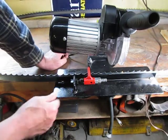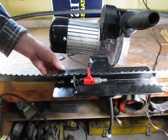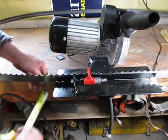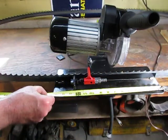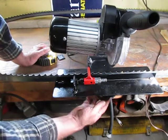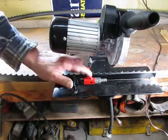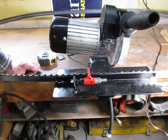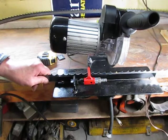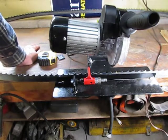It took me about two hours in the shop to construct this. The dimensions don't have to be exact, but my plate is three-sixteenths steel — quarter inch would be better — and it's about five and three-quarter by fifteen and a half inches. This plate has a bolt welded to the bottom so you can attach it just the same way you would with your chainsaw sharpener. I made it a little heavier duty than Hudson's because you've got to pull the tooth through and back, and I wanted it solid every time so it returned to the same spot.